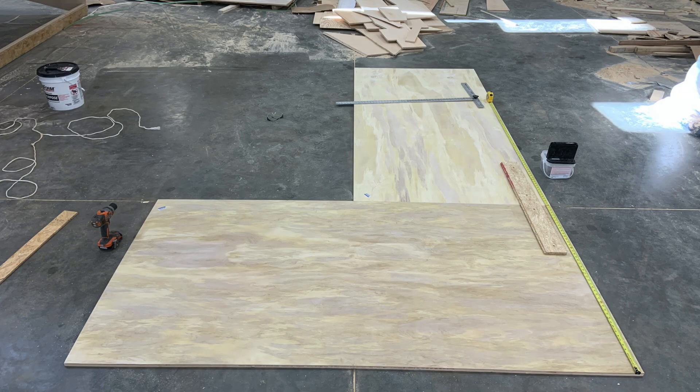Now let's talk about the construction. For the plywood that makes up your side walls, I'd recommend you use plywood that's three-quarters of an inch thick. You can get away with half inch if you like, but you might want to be sure you've got some solid framing behind it to make sure it's nice and stable. We start by laying out our plywood on the ground in the L-shaped pattern. I like to screw the pieces together at the seam with a scrap of wood to keep them from moving as I work.